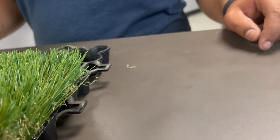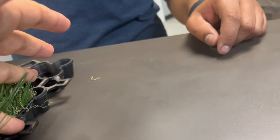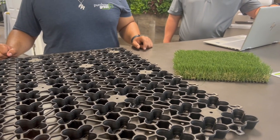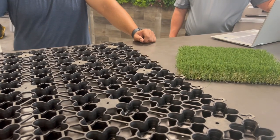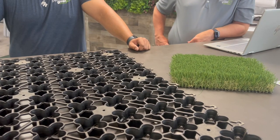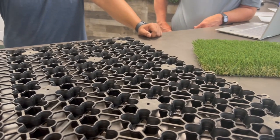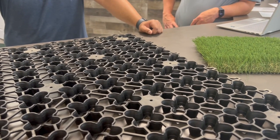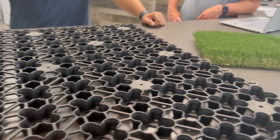If this represents the end, we should cut off these little hanger pieces. We're using steel staples, not galvanized — you want them to rust. Using an air compressor stapler, probably two-inch staples, though one-inch is fine if you're only shooting through the backing. So one-inch steel staples, not galvanized, spread them everywhere.